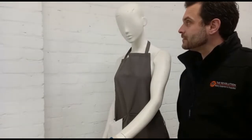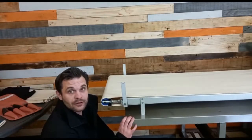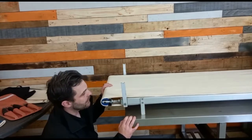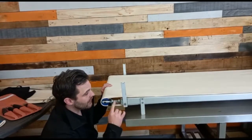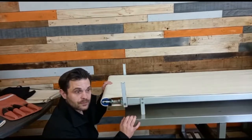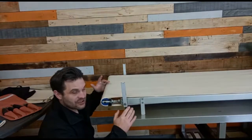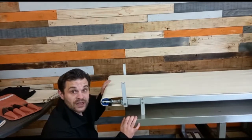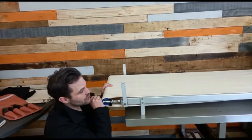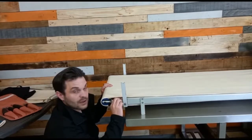Let's go through the parts of the pastry roller that we'll need to know. It's the idle roller — a non-powered roller found at the end of the tables. On the idle rollers, on the majority of machines, you'll find tensioners. These are tensioners that help us tighten up our belts to the correct tension and allow them to operate without any issues. Over time, it's probable that you'll need to use these tensioners to take any slack out of the belt as it stretches. These will need to be in the shortest position when we are taking our measurements, and that's easily done by just turning the bolts to reduce the thread up to the end.